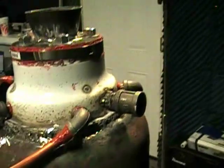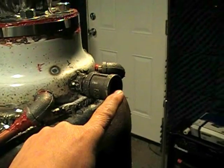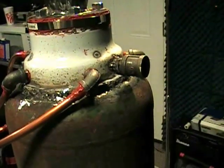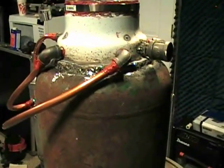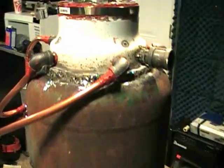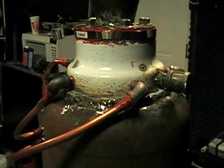Since I'm on the back of this thing, I'm going to start here. This is my ignition port, and this will have a piece of steel pipe that comes out and protrudes from the back of the barrel — this will be where I light it up. This is an invert system, so unlike the FEMA or the downdraft, the Woodhopper, once it's loaded up, has an airtight lid that goes on it, so the only oxygen that can enter this system is through air nozzles. For mine, I've got a total of five of them.